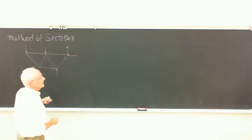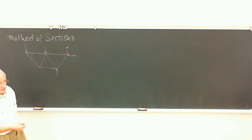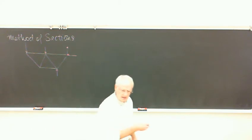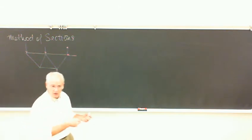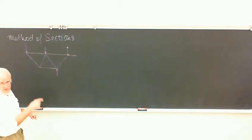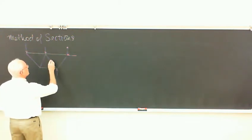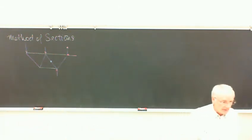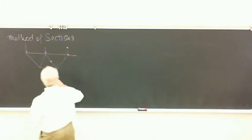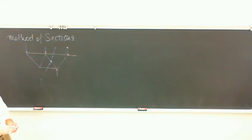It could be, however, that you only need the force in a few members. You don't need the force in all of the members. For whatever reason, if you're working as a civil engineer and you're concerned about one part of a bridge because there's maybe more rust there than another part, and so you want to analyze that part alone and not the entire structure, look at these bridges. There could be hundreds of these members in there. Say you only need to look at the force in that member. If we use method of sections, what we do is imagine a cut through there,